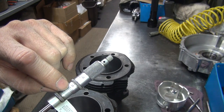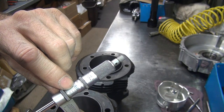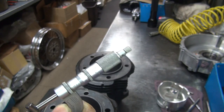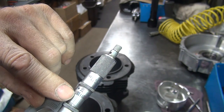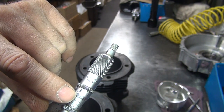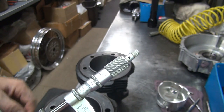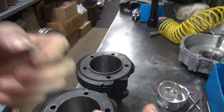It's just a little bit under zero, so you're at 249. If you go over to your graduations on the side, you want to line up the scales — when they line up, that's your number. You can see it's close here, gets worse, then starts getting closer again. All the way over here, you can see where it lines up. Zero is here, then nine, eight, and seven. Eight is the closest it's lined up to, so this is eight tenths of a thousandth, making it 249.8 thousandths — two tenths of a thousandth under the quarter.